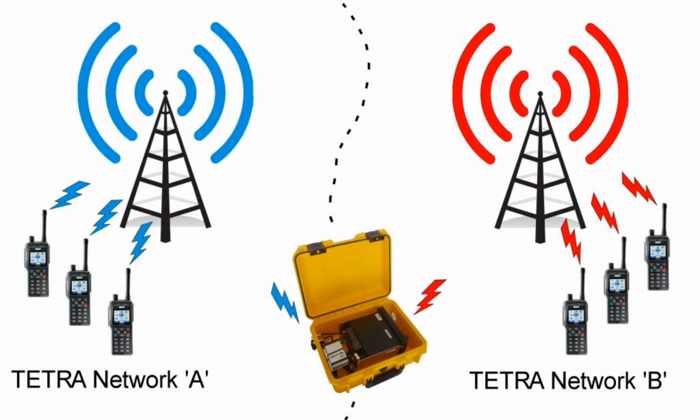You keep mentioning grounding. How meticulous are we talking here? Is it just connecting a wire? Well, it's more involved than that. It's critical for protecting against lightning and power surges. The manual specifies a single-point ground, using a specific type of green or green-yellow wire. And it stresses checking the factory connections too, make sure they're tight. It might seem small, but proper grounding is a fundamental layer of protection. Power supply side, it takes standard AC, but needs its own external fuse and breaker.